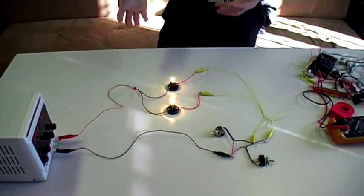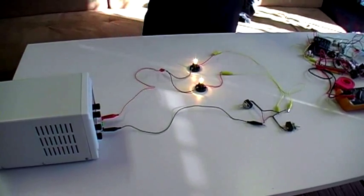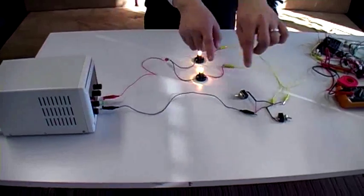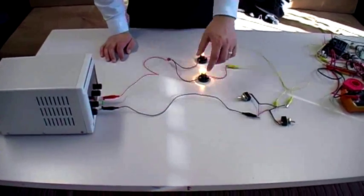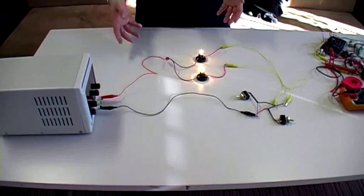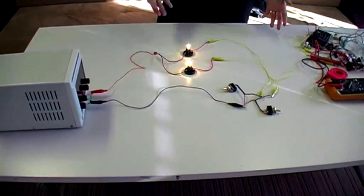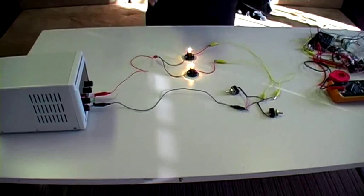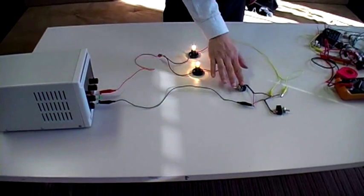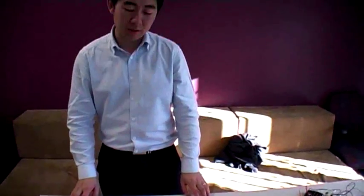This is how household lighting circuits are structured: each light for every room is connected in parallel with each other, with a switch on the side of the active wire for safety reasons. A typical household circuit also has a power point circuit and separate circuits for main appliances like the washing machine, stove, and air conditioning — each with its own individual fuses and safety equipment. A household actually has many circuits all in parallel with each other, each with individual switches and fuses. Within the lighting circuit, every light bulb is connected in series with a switch but in parallel with each other light bulb.